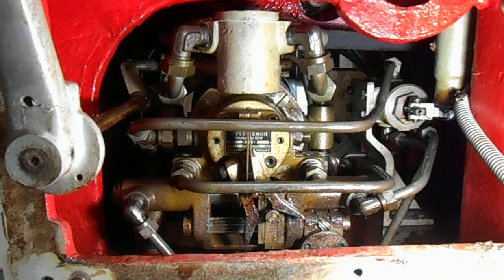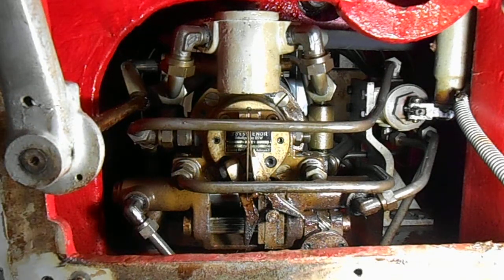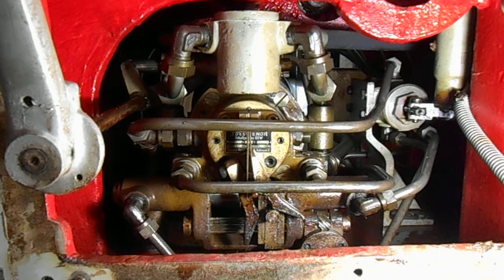That's my understanding of how it works, and hopefully that helps. Josh especially — thanks for helping out. And Richard — as to just how this pump works and where this noise might be coming from. Richard might be right, it might simply be wear in the pump and there's nothing we can do about it. But if you do soften the changeover down by taking the valve right out here, the noise does go away. So it's definitely only there when the table gets really heavily loaded, or when the pump gets really heavily loaded, which it shouldn't be doing, I'm guessing.